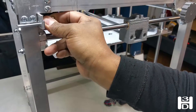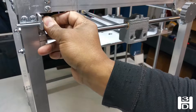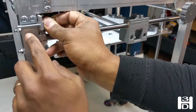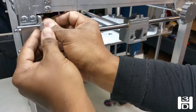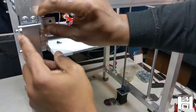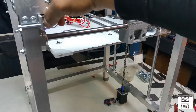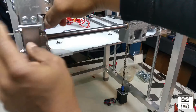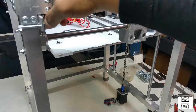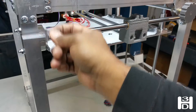When it sits — with the top at the frame and the bottom just above the SHF-12 — your screw should line up below the screws for the frame corner brackets and the screws for the SHF-12s. You don't want these screws touching those or getting in the way or having any kind of collision. So right about there — this looks good position-wise as far as its height.